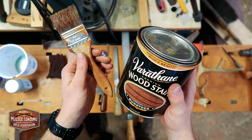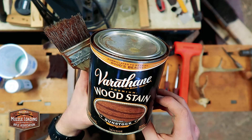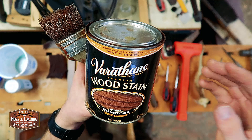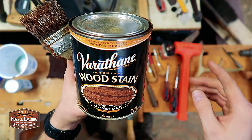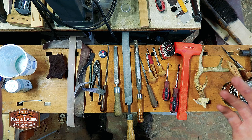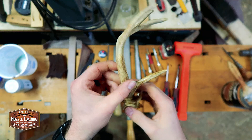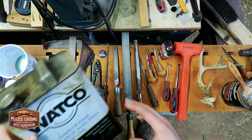You're going to need some wood stain and a brush. This is really up to you as to what kind of stain you have. If you can afford it, it's good to grab a couple of different colors of stain because you're not going to be sure how the stain will react with your specific stock. So even though this is a Varathane gunstock wood stain, the color I get on my stock might be different from the color you get on yours. I've got a cheap hardware brush to apply it. Between staining and oiling, you have the optional step of hitting it again with your Scotch-Brite. You can also use a piece of antler to do what we'll call burnishing — a simple treatment to give the wood a varied surface compared to just plain stain.